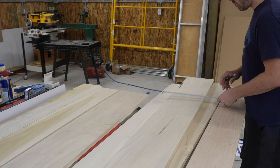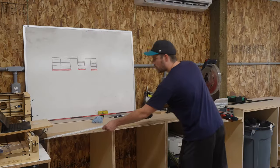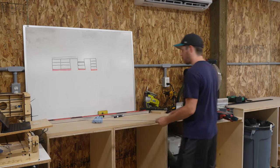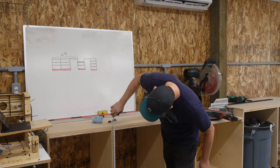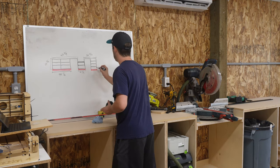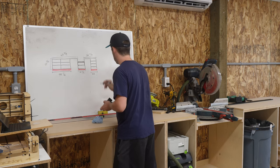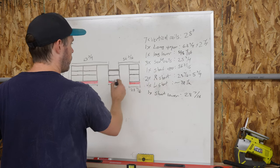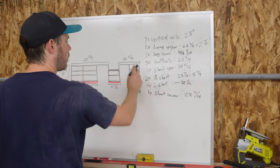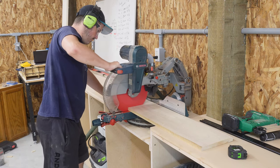I took a couple minutes to set up the proto miter station and got to work figuring out the face frames for my drawers. A whiteboard came in really handy — you can see me throwing some numbers up on the board. I wouldn't recommend trying to copy them exactly since they're based on my very specific setup, but you can see how I've broken down a cut list based on the actual constructed frames. With the cut list on the board, I got to breaking down the rough lumber — at least we get some action shots of the miter station before it's even done.